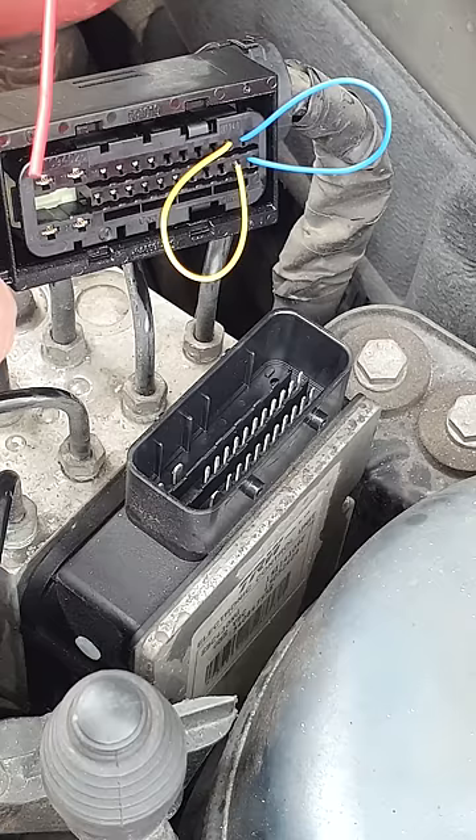If yes, then in all likelihood the joints holding these first four pins to the PCB have either got dry joints or the solder joint has come undone.